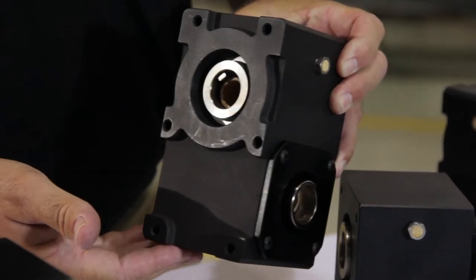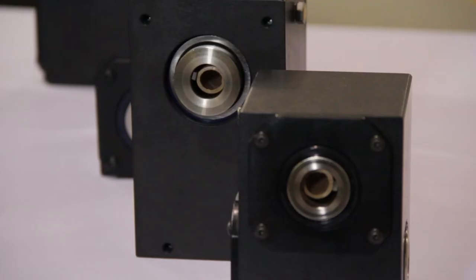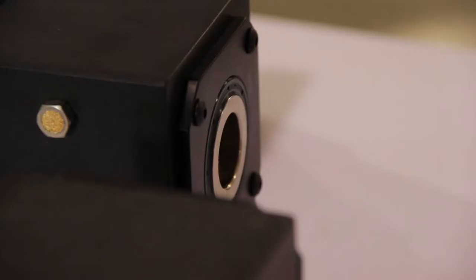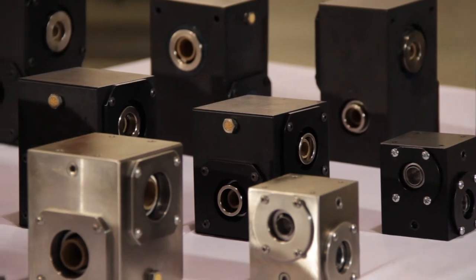Each gearbox has two helical gears that mesh at 90 degrees to rotate power. They are bi-directional and slide axially along the keyed shafts for easy installation. There are also vast improvements over float and slide style right angle models made by others. All WC Branham gearboxes are shipped pre-lubricated and installation ready.